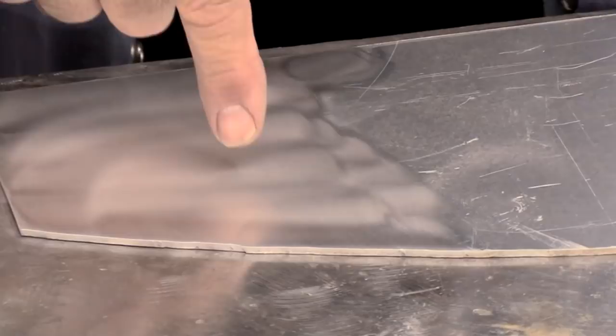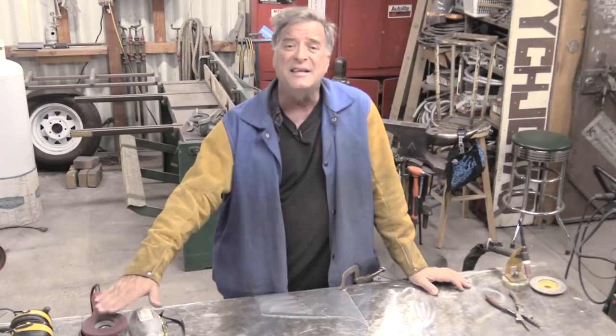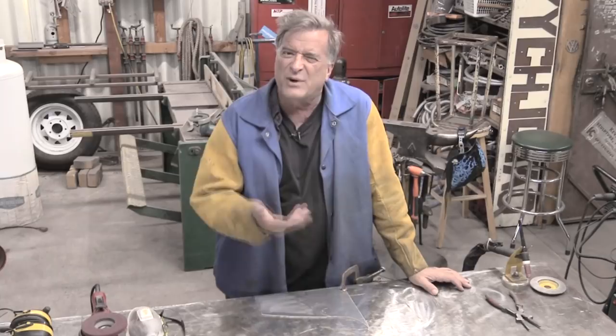So, as you can see, all of the little gear marks are gone. You can see my reflection in there, see my finger in there just a little bit. Another pass or two, a couple of different directions, maybe a slightly different grit or different weight surface prep disc — that might help bring out the shine a little bit more. But the cool thing is, it doesn't take the metal away, it doesn't leave big gear marks, you don't have to go back and fix more damage that you made.